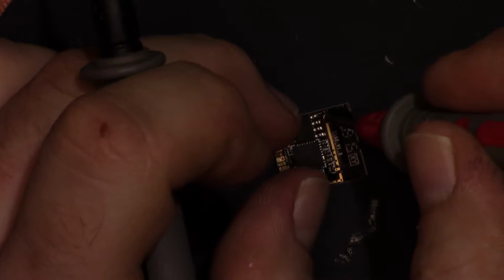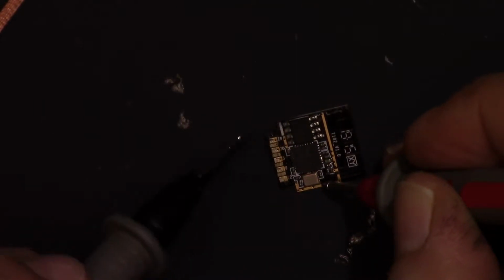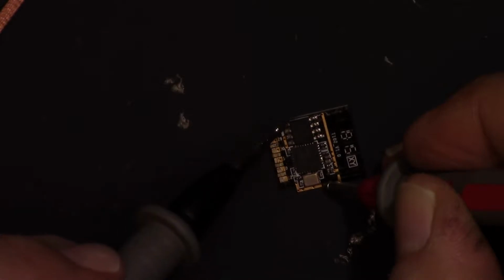Alright, so in this EEPROM, ground is pin 4. Yeah, none of those. And this casing sometimes would have a can over it if it needed it. But none of these are ground. But that's ground. This must be a serial EEPROM. Let's see if power. Yep. So 3.3, ground, and the rest of it.